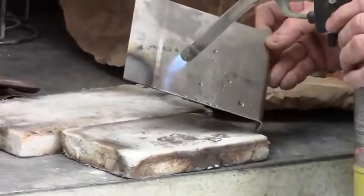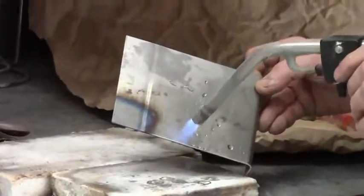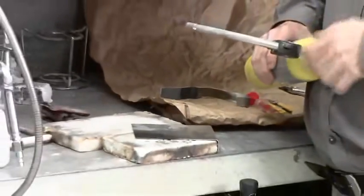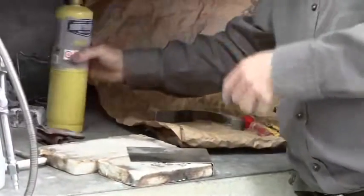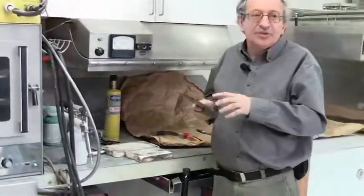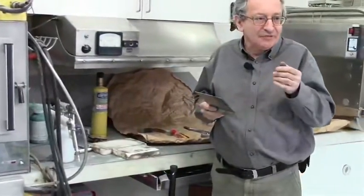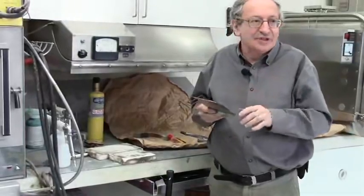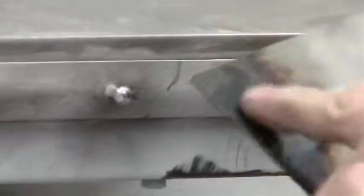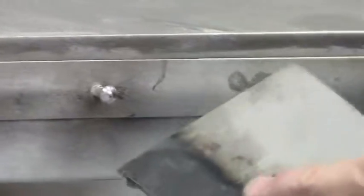So you can see the color change. Okay. Don't heat it up more than 300 because we don't want it to oxidize and flake off. We just want a very, very thin layer of oxide which is adherent. You can see here the water beads and falls off, here it wets and stays. Okay?